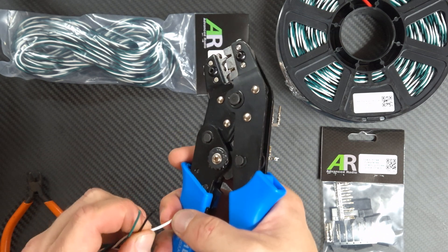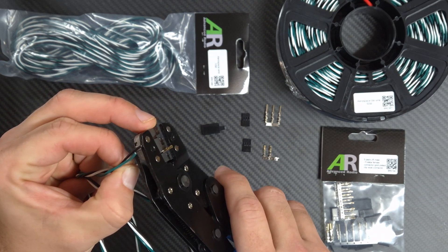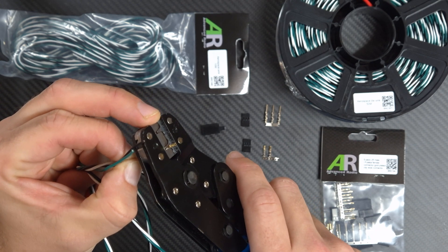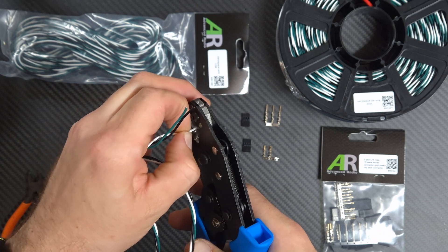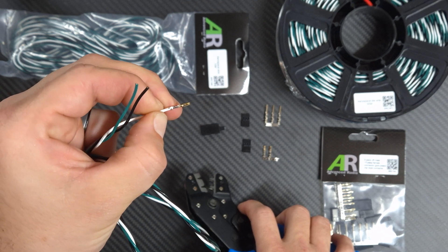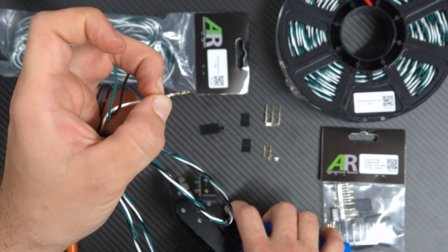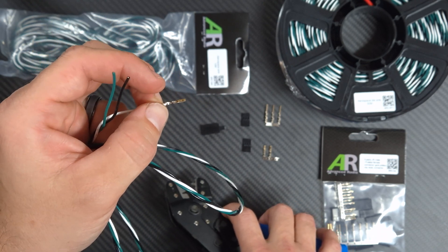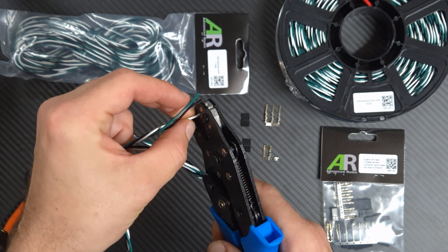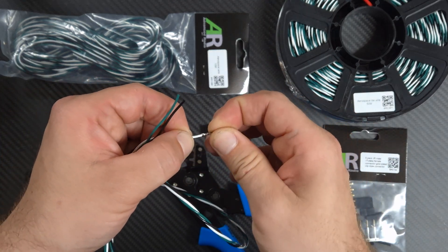It's a simple matter of just feeding the cable through and making sure when you're coming through the outside, you can see a tiny little bit of the metal showing through there, and then just squeezing down on that one. Pull it out and you'll notice that's the start of a crimp. There are two pieces: the two little wings which hook into the insulation to stop the crimp from coming off, and two little flat pieces which fold over the top of the metal wire to give you a good connection. I prefer to put it in the front jaws as well to double crimp it — now you've got a good crimp on that.